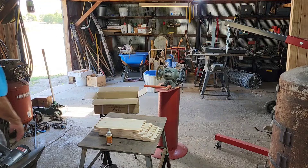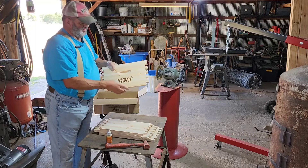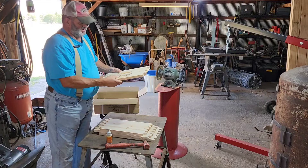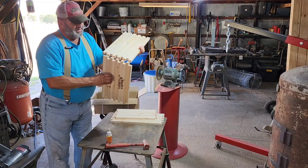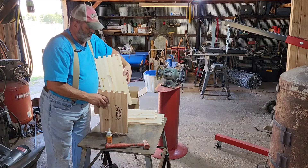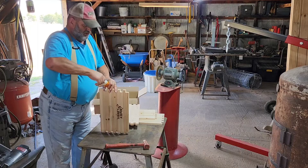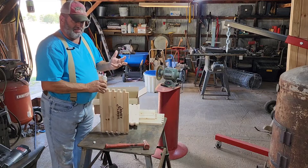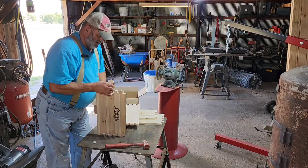First thing, we're going to put this hive body together with a little bit of glue. Traditionally they were just nailed together, but you'll notice they have handles in the sides — you want the flat side of the handle up because these go together differently. One long side goes to the short side; there are handles on those sides as well, so we know they go into this orientation with both handles pointing up. We're going to put a little bit of our Gorilla brand expanding glue in there — as it dries it expands, fills in the gaps, and you get a tighter joint.